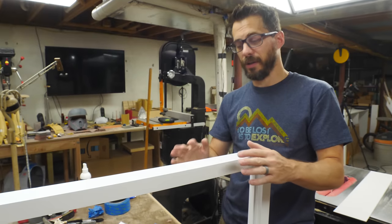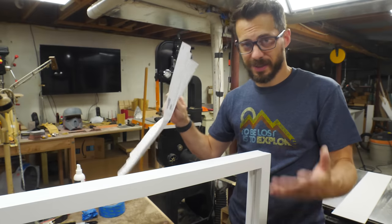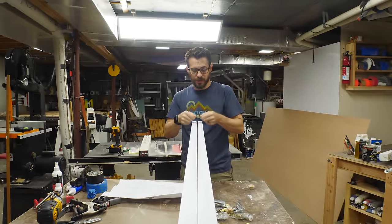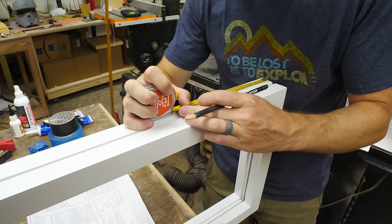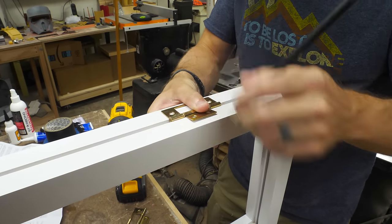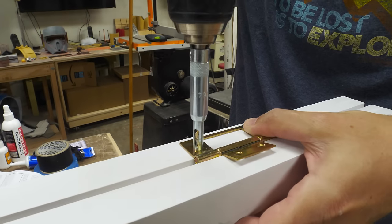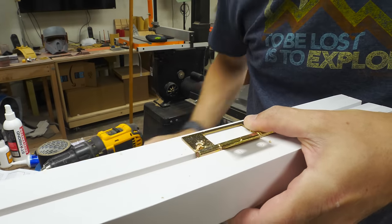The frames are all painted and ready to go, so now we're going to put them together to make the bi-fold doors. We've got a really simple DIY set of instructions and hardware, and if you follow the instructions this should be pretty easy. It comes with these little hinges that you don't have to mortise — you can just set them right on and screw them in place. To drill these holes I'm using a self-centering drill bit — it has a little spring so when you put it in, it centers itself within the hole, making it perfectly centered within the hinge.